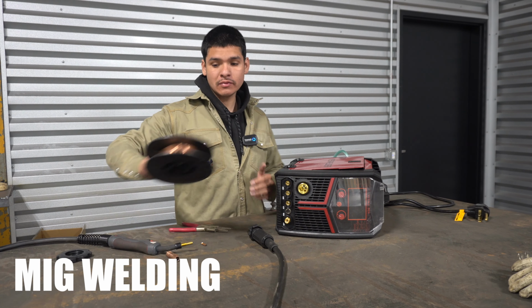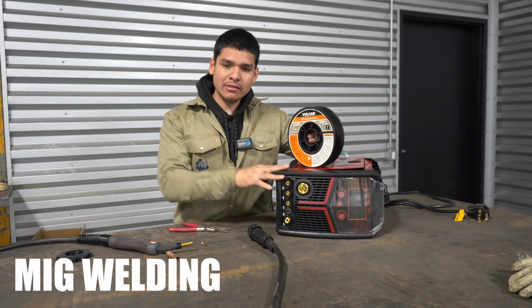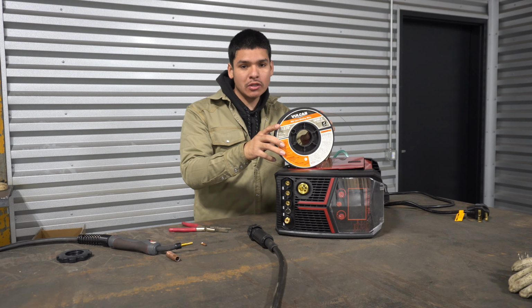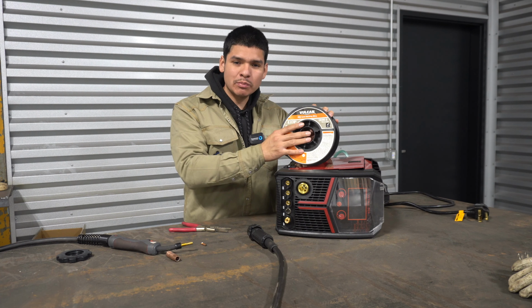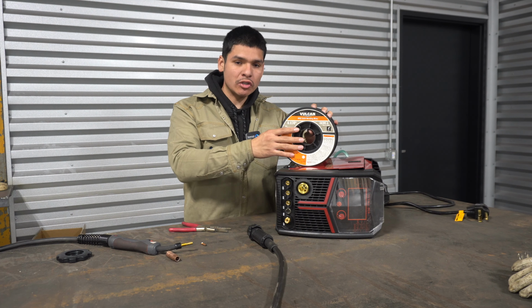Okay guys, so MIG is the first procedure that we will talk about in today's video. The wire. Right now I'm using a MIG wire. You can use gasless wire or this one, which requires gas 75/25. You could pick up from your local gas supplier. I always recommend to use MIG wire instead of gasless, simply because it welds better, it looks better. Especially if you're new to welding, this will be a lot easier for you to learn how to use.